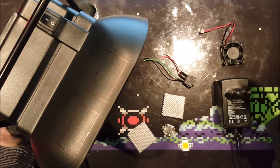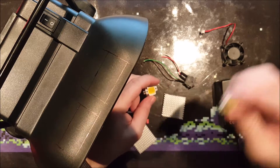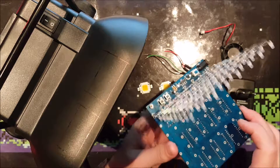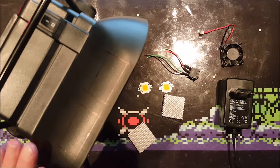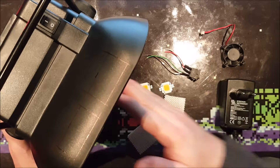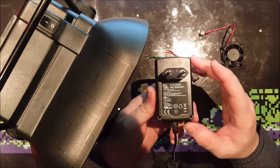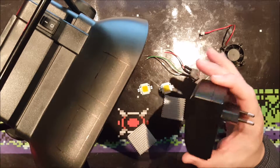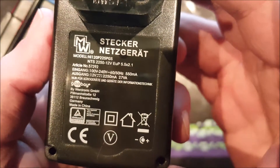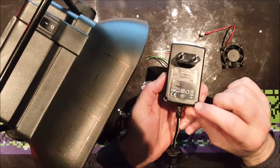Hi guys, and thanks for watching. Today I'm going to add two 10-watt LEDs to my solder fume extractor. I'm doing this because it blocks quite a bit of light on my desk, and now is a good time because I really want to finish my LED cube. Since the cube involves quite some soldering, I thought it might be good to have the fume extractor running. I'm pretty sure the fan inside runs on 240 volts, so I bought this 12-volt power supply which I'm going to try to put inside the case. This power supply is capable of putting out more than two amps, which should be enough for these two 10-watt LEDs.